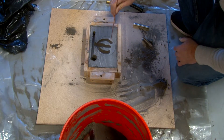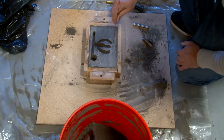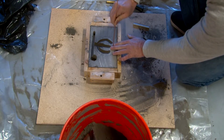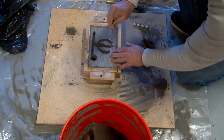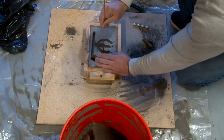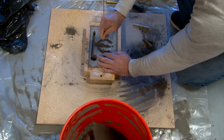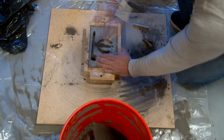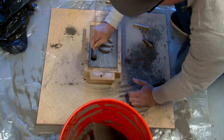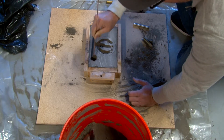This is a TIG rod that I have — about an eighth inch in diameter — and I'm going to poke a bunch of little holes in it. I don't care about the back side because I'm going to clean it off, but I do want to be able to get any steam or trapped air out of there. So I'm using a little rod to poke holes and clear that out, so as the aluminum fills in, the air can be displaced and pushed out through the holes. Here's the spin trap, so the aluminum can easily flow in and the air can escape out the other side.